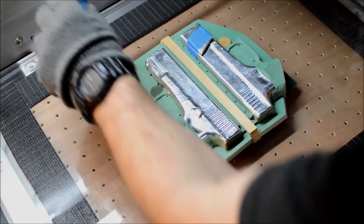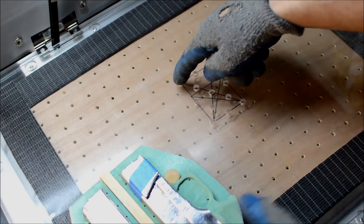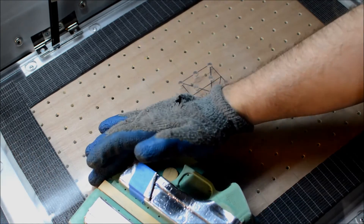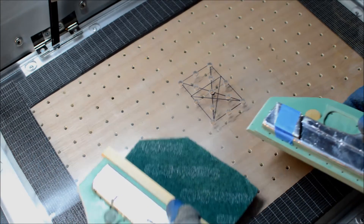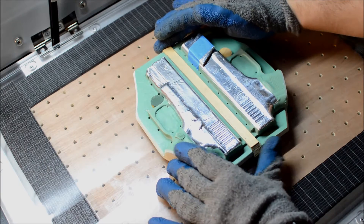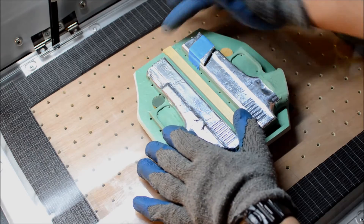After you've got your Lexan cut and your gasket made, cut a few holes — basically a two-by-two square pattern. If you want more, do more; I haven't tried going any bigger so I don't know if it would be better or the same. In between the Lexan and the mold is scotch-brite — it works, but it's not great and is a little flimsy. An aluminum or steel breather mesh would definitely work better and give you a much more solid surface to lay the mold on top of.